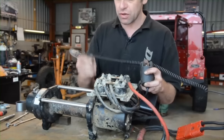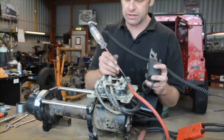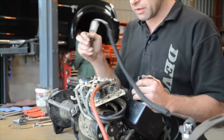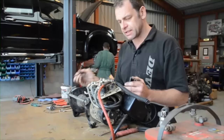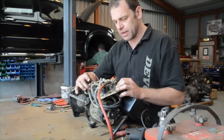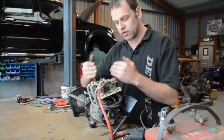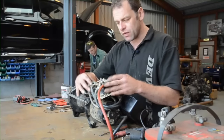It's fairly important to make sure you've got a good connection on your test lamp. Every so often it's worth just putting it on the main lead to make sure your light is okay. This is telling me that all four of these solenoids are fine. If, for any reason, we were testing a solenoid and it didn't light up when we clicked it over, then that solenoid is dodgy — we would have to just take it out, renew that solenoid, and that should fix the problem. But as I said, the winch is not working in either direction, so there would have to be two solenoids that didn't work — one on each side. But these are working fine.